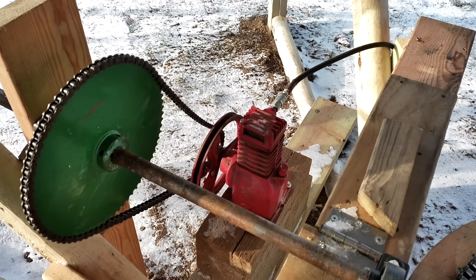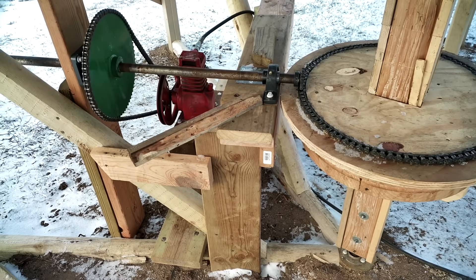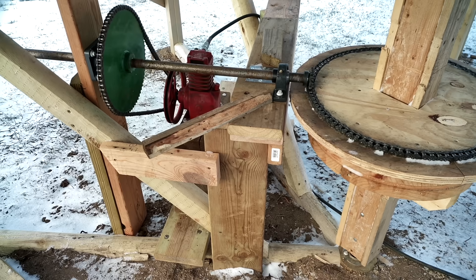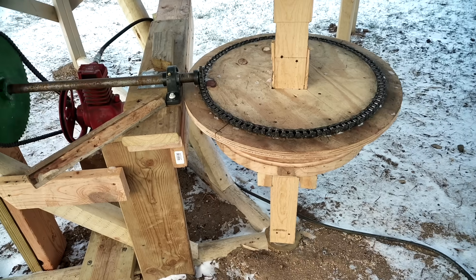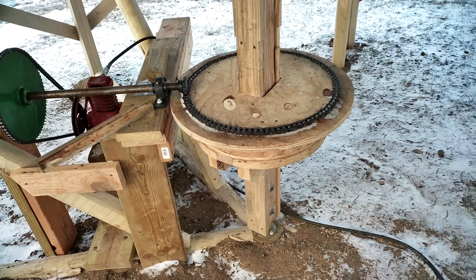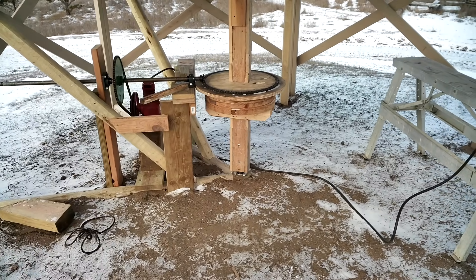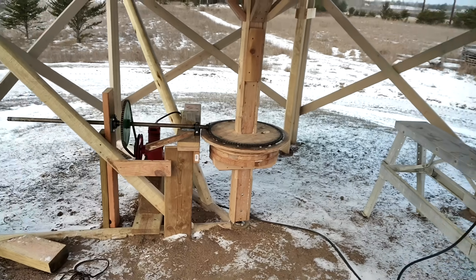You can see when that compressor is pressing down, the chain bows. Unfortunately, the wind turbine just isn't powerful enough to turn that compressor except very slowly — it needs to be like over a 15 mile an hour wind speed. It's just turning it a little bit, but it is working. The side bolt chain arrangement that I got is working. When it was going faster, it really started shaking the whole turbine. It's just kind of inching along right now and slowing down. I do have it all hooked up — I just don't think this wind turbine has enough power to really turn that air compressor.